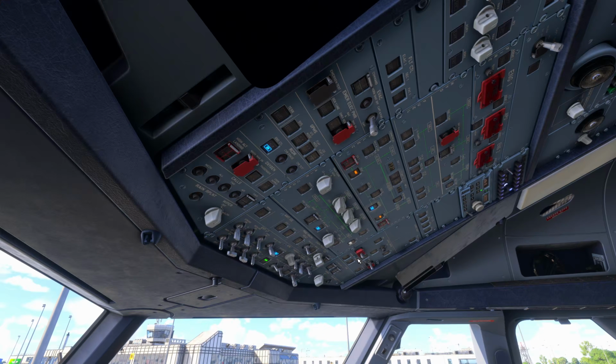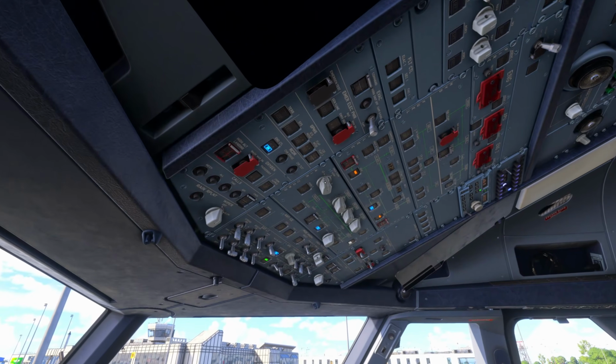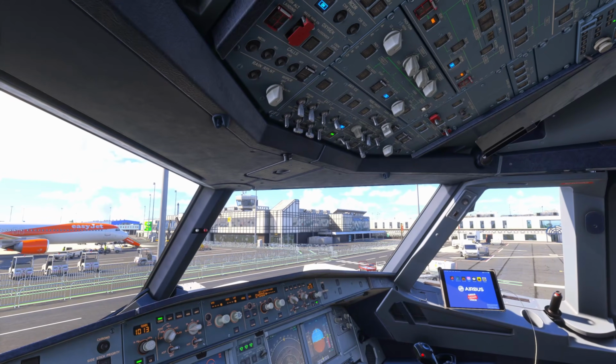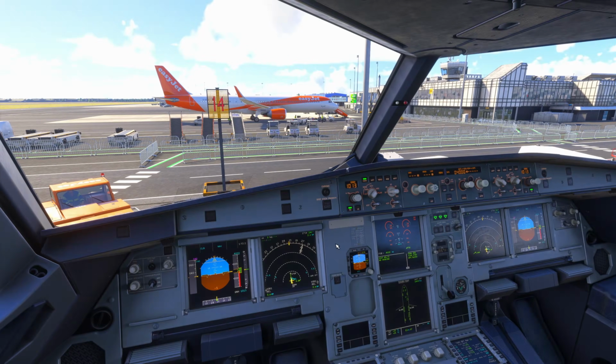Again, as mentioned, air conditioning in terms of packs is as required. We'd review the pack flow selector. So we've got below 130 passengers. We are able to turn that down to low, save a little bit of fuel. And that's 160 in the Airbus A320 one. We've got more than that today, so we're in the normal position. We would use high. We've got abnormally hot and humid conditions on board. Again, pilot's discretion. So all that remains now is really to get our clearance and continue with our final checklists,